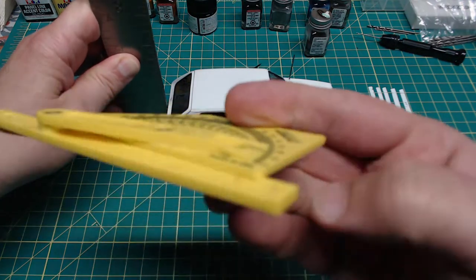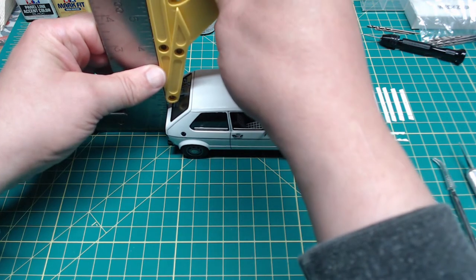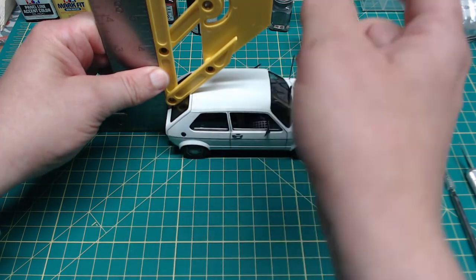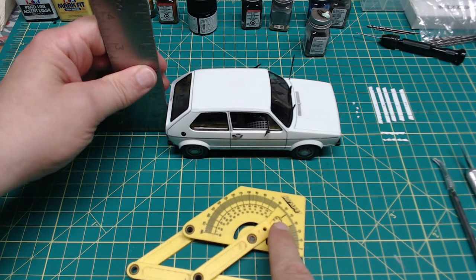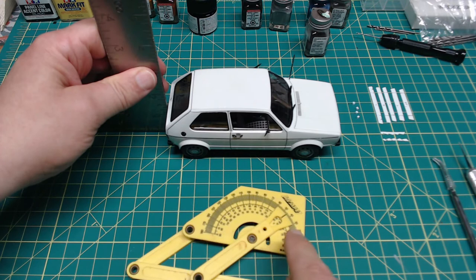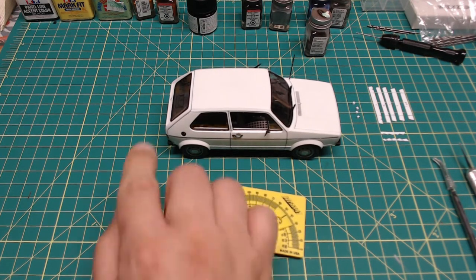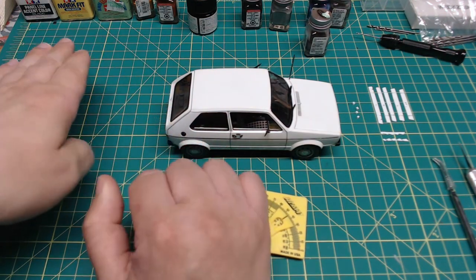So a little protractor, and this I just opened up until I was flush with the window. And flipping it over, there is the angle. I did a couple of measurements, and the average measurement I got was actually 47 degrees. So, with that, I was now able to cut an angle on the supports I would have to make so that the louvers would then sit parallel to the ground.